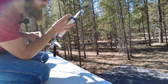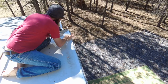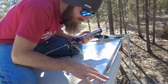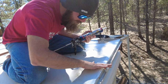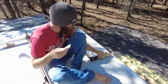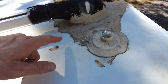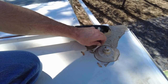Every once in a while you want to peel up old caulking and completely replace it, but you don't have to do it every time, which is nice because that's a big project. I like to use an E-pattern — I actually learned this in welding. When you're laying down a bead, just make little E's and it gives you good coverage. Wipe the caulking off your hand, discard that paper towel, grab a new one, and continue working around the roof making sure there are no spots for water to leak in.